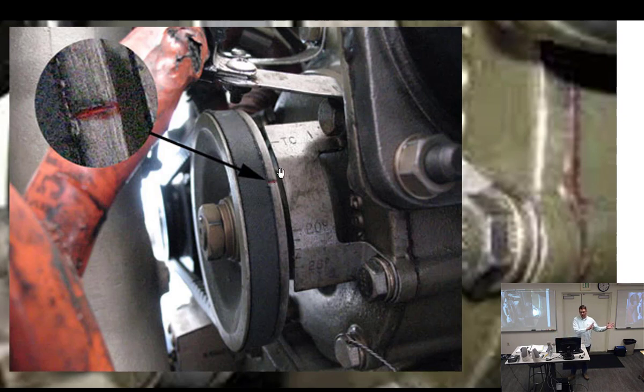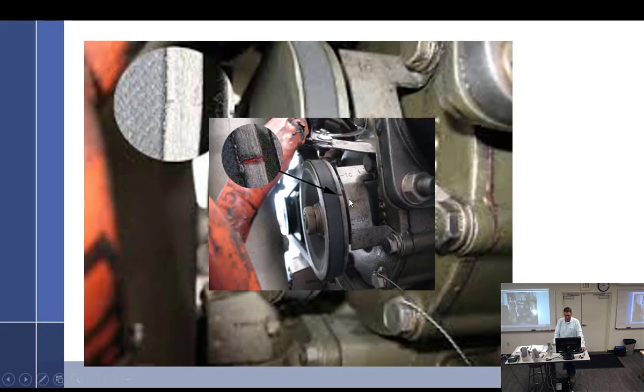You just have to think things through before you assume that they're right. Just like with the starter ring gear support assembly on the Lycoming, don't assume that top center is where it's supposed to be. First verify it. Once it's verified, you have a usable tool. Kevin, how do you still have yours on? Well, they said they don't want any. Service bulletin. Oh, okay. People don't always comply with service bulletins. Or the engine shop that built it was like, we understand why it's there. It really makes life a lot easier. So if you understand why it's there, what it's about, I still think they're a good thing to do.